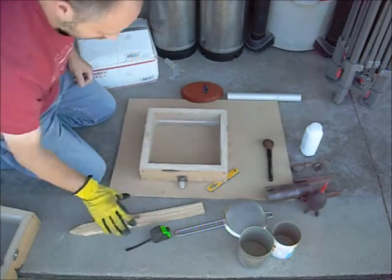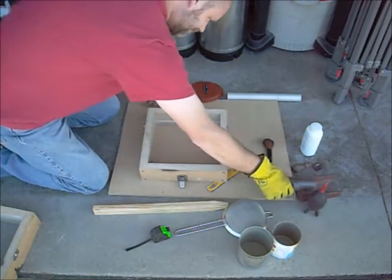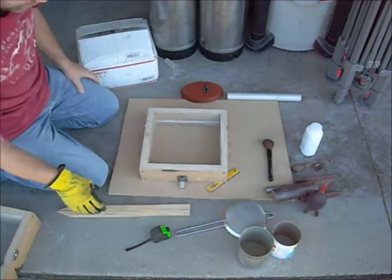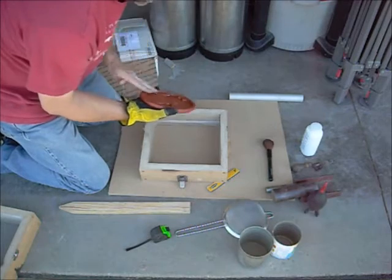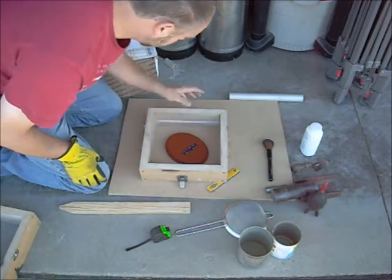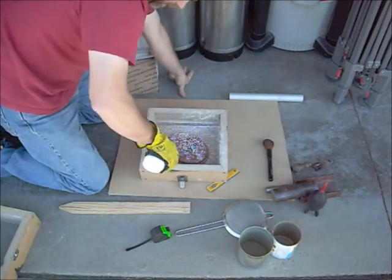Good enough. And I grabbed the glove because somebody mentioned using a 2x4, 2x2 or something like that instead of using this big old piece of metal to pack my stuff in. So I may try this, pointy end to get down in the points, although it's a little busted, but I'll try it and see how it works. And I'm going to assume, and now they say never assume, you still have to use the release agent when using Petrobond sand. So that is what I'm going to do here.